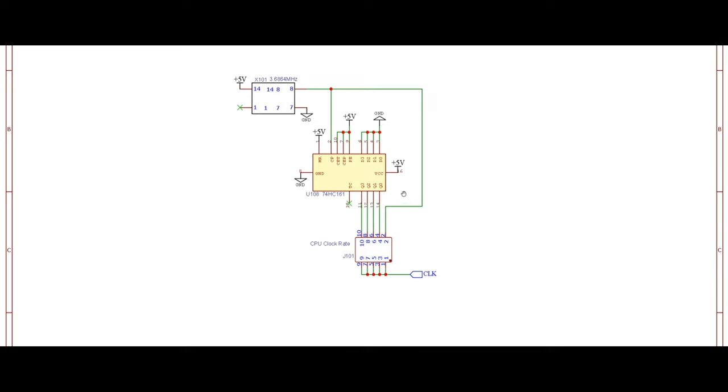Now, an interesting thing here is that if you think about a 4-bit binary counter, with every 2 clock pulses that we are receiving on the clock signal, or as input to the chip, we're going to be toggling Q0 only once. Q0 is the least significant bit on this binary counter. And basically, if you think about it, for Q0 to go through a full cycle of going from 0 to 1 and back to 0 requires two clock pulses that come into the chip.